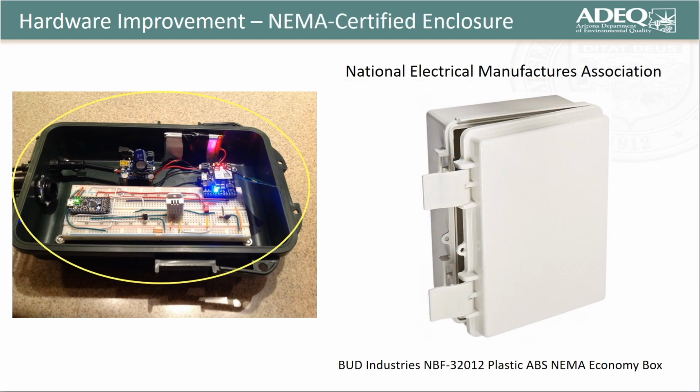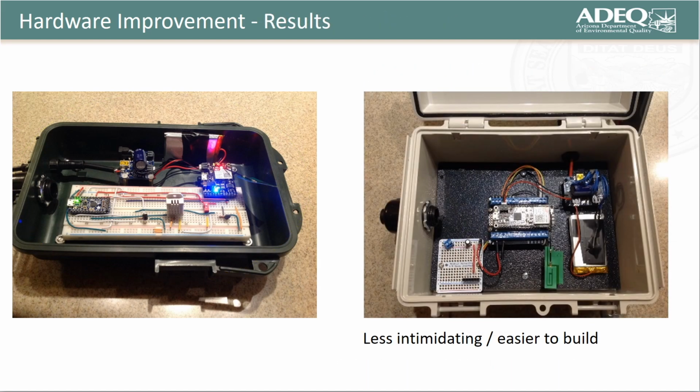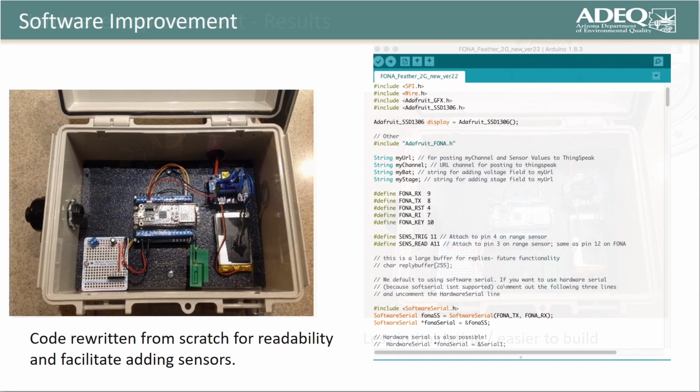We then replaced the Kayaker's lunchbox with a National Electrical Manufacturers Association certified enclosure specifically designed for housing electronics in outdoor environments. And this shows our new design. As you can see, the overall wiring and build is much less intimidating and easier to put together. We also updated the code to work with the Feather Fona hardware and commented it thoroughly so that it could be more easily reviewed, adopted, and modified by others. A link to the code for the original prototype and this improved design is included in the description of this video.